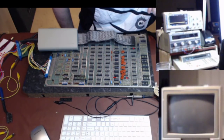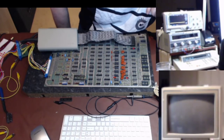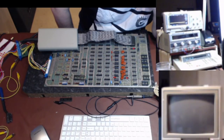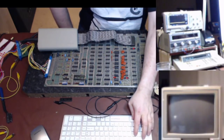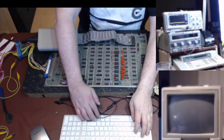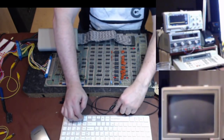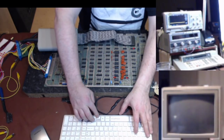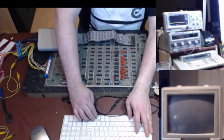Don't let me sidetrack you. The DRAMs also hang off the data bus. Yeah, but we've just proved that it wasn't that. I don't think they hang directly. Hang on, you've got me thinking now. Do the DRAMs directly hang off the data bus, or do they go through a marshalling buffer? It wouldn't surprise me if they go through a marshalling buffer somewhere.